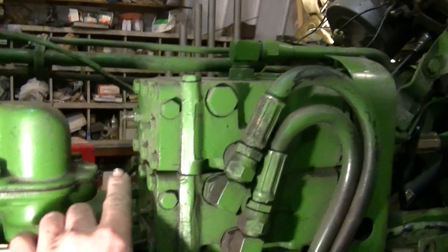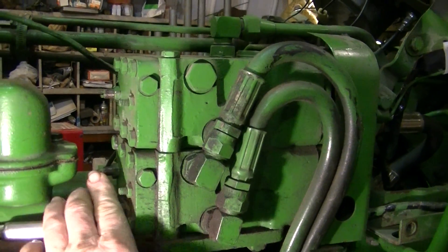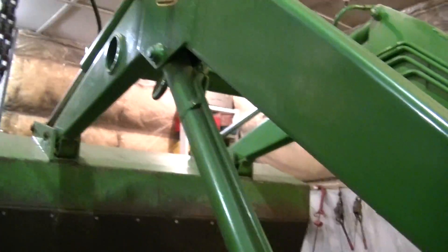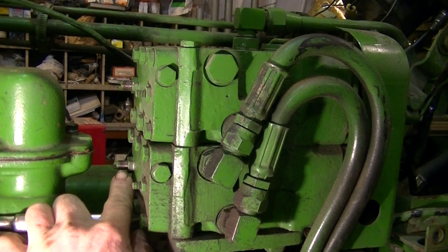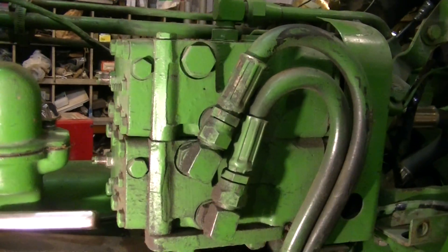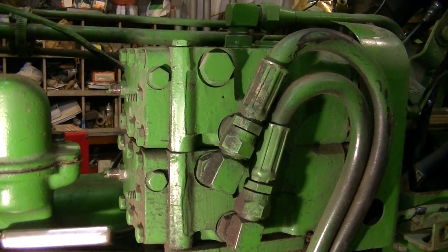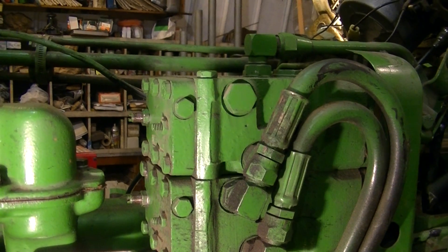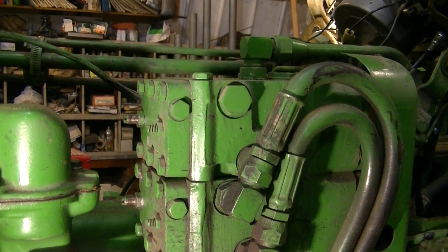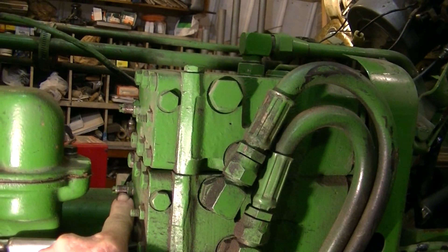This has metering valves. When I started working on this tractor, the hydraulics for the loader — it's a 148 loader — it was horribly slow. These metering valves were closed down to about an eighth or a quarter of a turn, so the oil was really restricted. That would be good for a cultivator with a very small cylinder, but I needed something that would rattle the bucket and lift at a nice speed. I've got good action now by moving these out — I tried it at four turns out and then moved it another three.